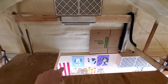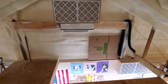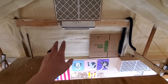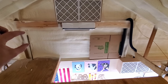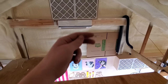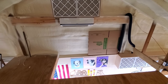Rather than having the 10-foot piece touch the floor and stop at the platform level, and then have a second piece up here that is simply only connected to the structure I build behind it — one piece, even distance all the way apart as they go down. Then I will add some bracing behind both of those super struts and add some brackets on this post, brackets on that post, brackets on both sides of the structure behind the strut, and that's where I'll hang another strut across the top for the hoist as well as the fall arrester and all that good stuff.